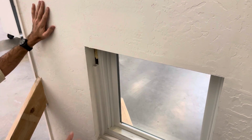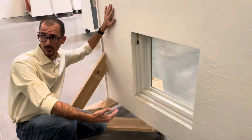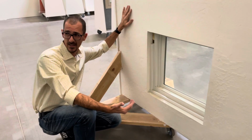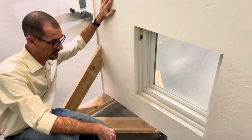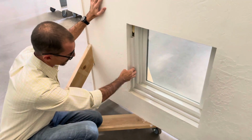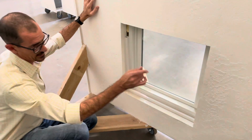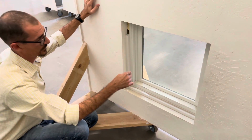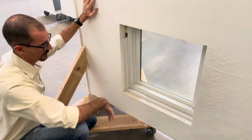We use this box trim for patio doors. If our door jamb isn't thick enough, it's a 2x8/6 wall. The casing is remaining, or we're putting on new casing. Sometimes there's a gap, and we'll use this box trim to fill in that gap. Once again, just like the flat trim on these other windows or this one here, it's all color coordinated to match our window products.